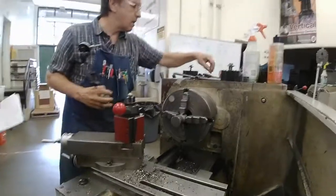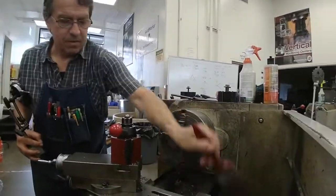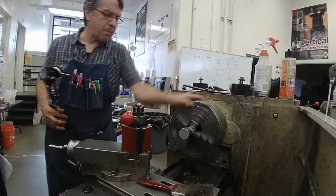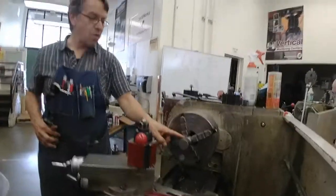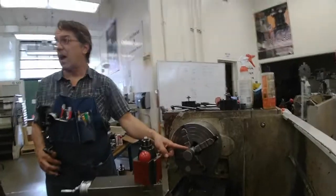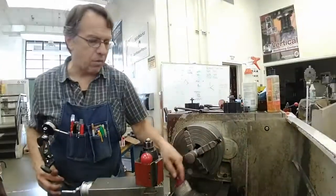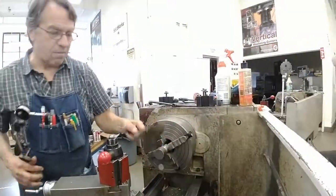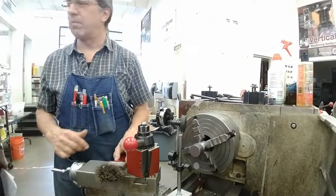You were going to say? I was going to say, do we have to reset this? Well, let's see what's happening. Yeah, I can see it going up and down. Now, if you have enough stock on here, it can be off-center, but how much? Depends on how much stock you've got. And you don't really want it way off-center because it creates balance problems, starts vibrating. So, general practice, true it up.